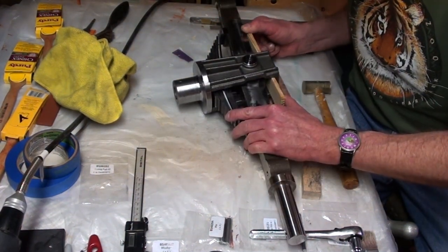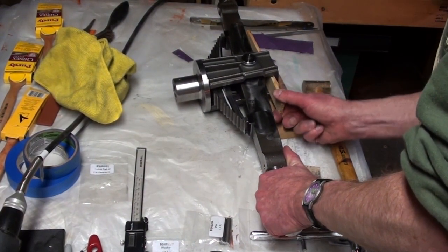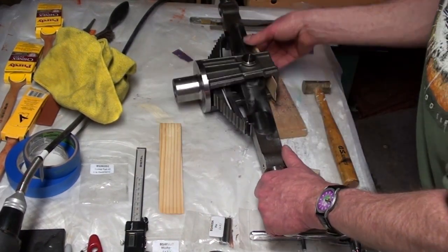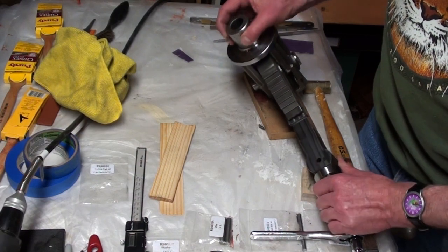For final assembly, we used some large bar clamps to help compress the leaf spring enough to align all the pivot holes. The pivot pin, a washer, and split pin are used to secure the assembly together. These parts should pivot smoothly, but without any significant side play.